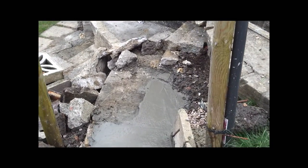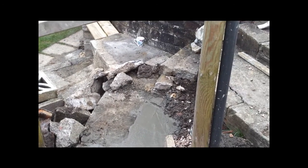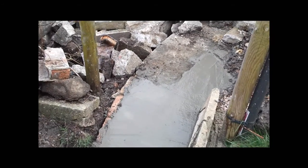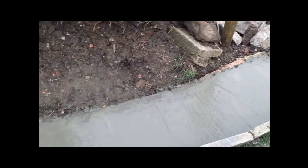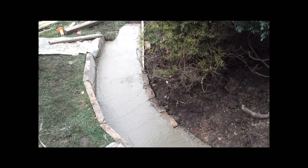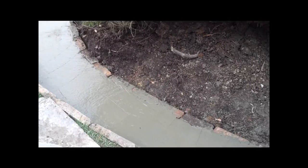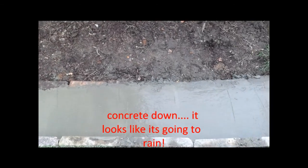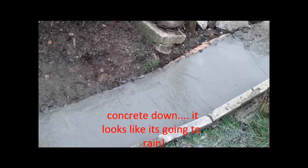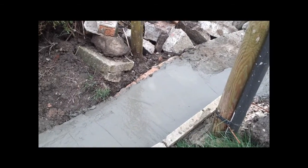There's the step that's been broken away and will need to be rebuilt once that concrete's gone off, at that end. But basically just a concrete-filled trench with a paving flag wall on the high side, and just some bricks to stop the concrete spreading on that side. There may be some decorative treatment in the form of stone and plants at a later stage.